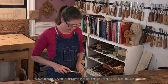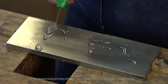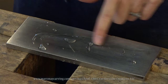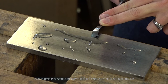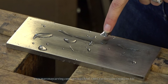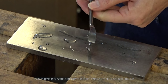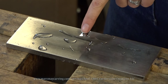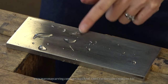So I'm going to show you how to do this. I'm just going to start out by putting some water on the stone. The difference with this one is just simply the positioning that you need to lay this on the stone. The actual bevel is on top of the tool. If you look at the inside, there's no bevel on there. I don't want to actually change that shape — this is the side that I want to put against the stone.